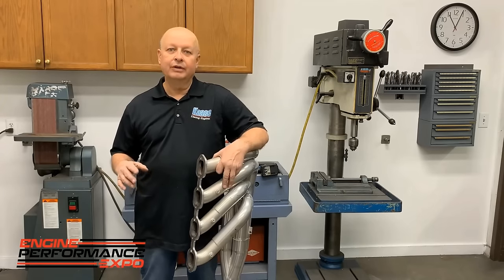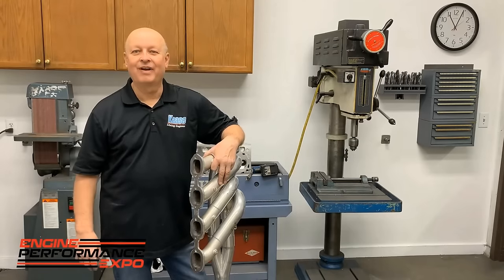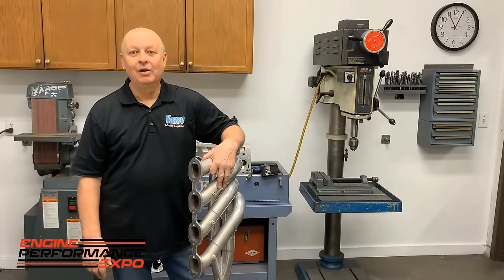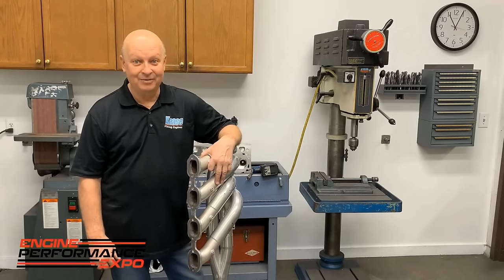Before you crank it, you give a little fuel, hold the carburetor about half open, and when it cranks up, it immediately goes to like 4,000 or 5,000. You know, you think, oh, it's hard on the motor, and I don't care. You know, but what it cares about is rust going up and down with the rings. It does not like that at all, believe me.